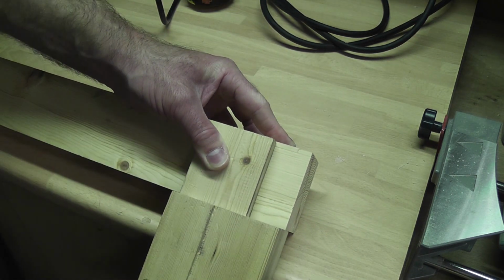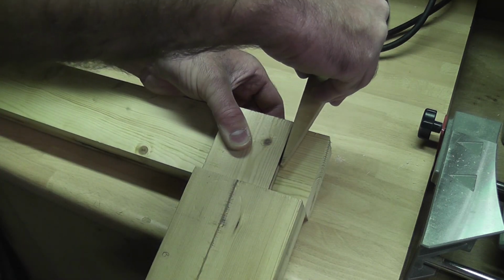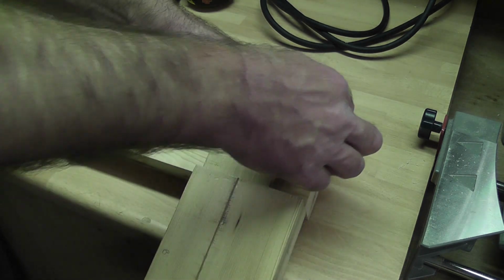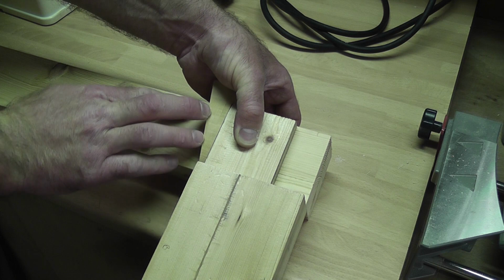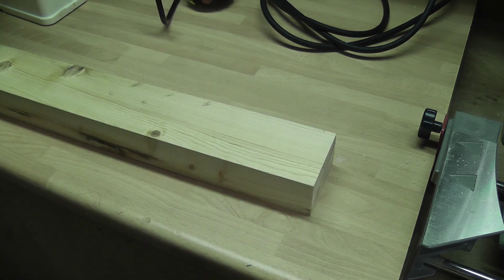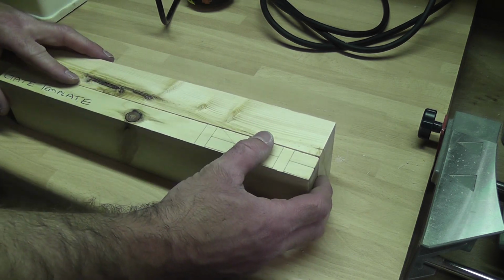The wedges that I cut later are cut across the grain, which isn't ideal, but it works. Cutting along the grain for stronger wedges is much better. But as this gate is an experiment, I wasn't too fussed. Plus, the 20-year-old gate that I already have up in the garden has cross-grain wedges and is still in one piece now. So whilst I know they are weaker, I do know that they'll last.